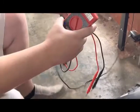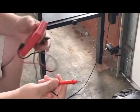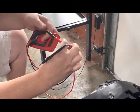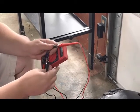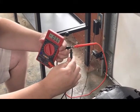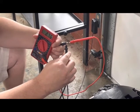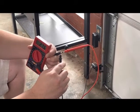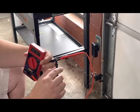The way to test the charger is with it plugged in — take one probe from the tester and place it into the tip of the charger, then hold the other tester against the outer rim of that tip. You can see it's showing 27.56, so that's about average. With a 24 volt battery your charger will usually show between 24 up to 28 or 29, just as long as it's over 24 so it has enough voltage to charge the battery.